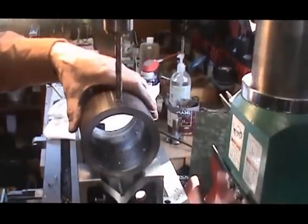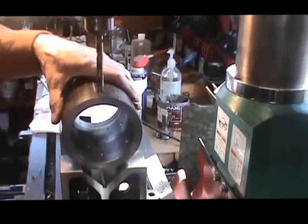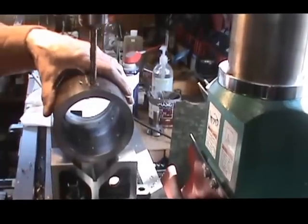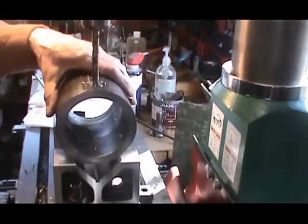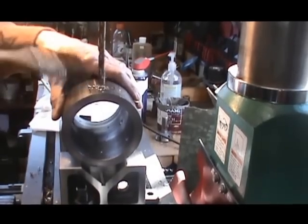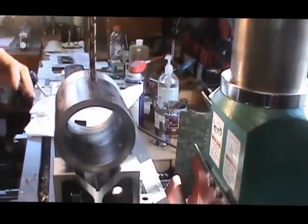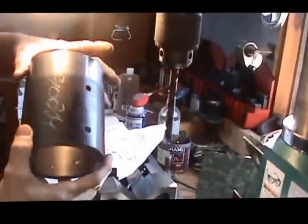Okay, we're getting ready. We're drilling some holes in the pulley hub. This is where the babbitt will be poured inside this thing, and what these little holes are here is we'll weld the very outside where he's entering with the bit and leave that hollow hole on the inside, and that babbitt, when it's poured, it will go into those, keeping that babbitt from turning on the shaft. And what he's doing there, he's got roughly 6 holes drilled into that, as you can see right there.